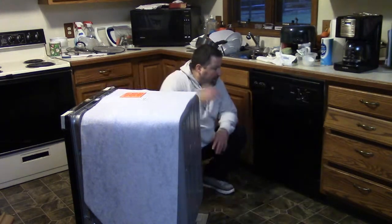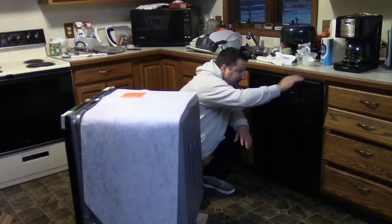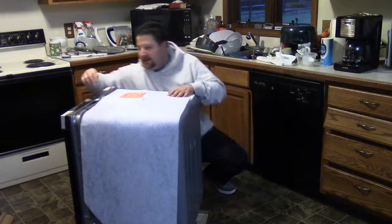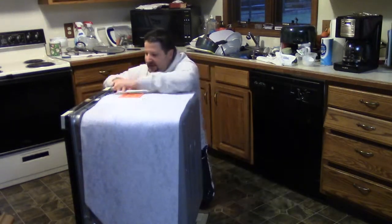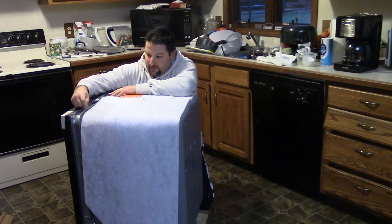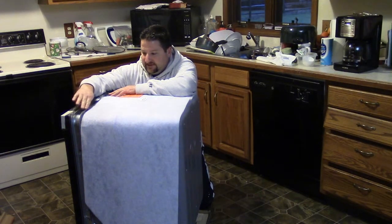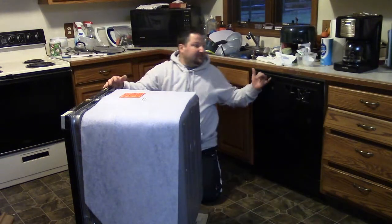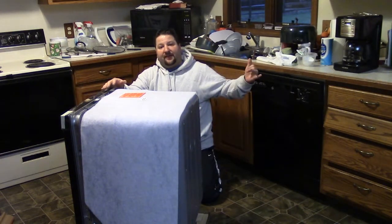So the way these come out, there's going to be screws underneath it. There's usually two. There's little wings that come off the top. This one doesn't have it yet. They're probably going to be in the bag, and I'll hook them. They'll tab in right here, and I'll show you guys this here in a second. They'll tab in here, hang out, and you screw up into the countertop. It's those two screws that hold that thing in place.